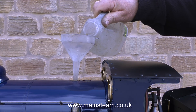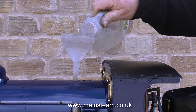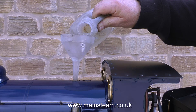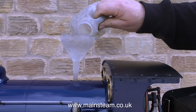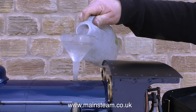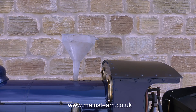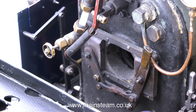The water filling method at the steam workshop is quite ingenious in a simple sort of a way. We have six of these milk bottles which are in a plastic box. All you do is pick up a milk bottle full of water, tip it into the boiler, then pick up another milk bottle full of water and so on and so forth. It's a better idea than holding a large heavy container over the engine. In no time at all the water level in the gauge glass is near to the top, and now I'm putting some charcoal soaked in paraffin into the fire hole.